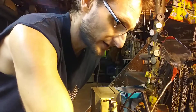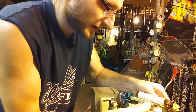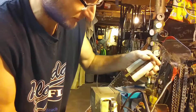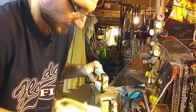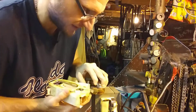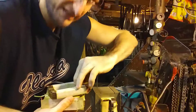Hey guys, what I got here is I'm gonna try to put together an isolation transformer. I have an old transformer I took apart from a microwave the other day, and it actually matched up quite well with this transformer. The theory is I'm gonna try swapping the primary onto this one, taking off the secondary which is the high voltage, getting rid of that, and then swapping this one in — hopefully not having to cut through it, which I'm doing now.